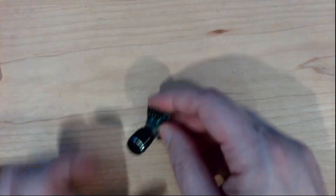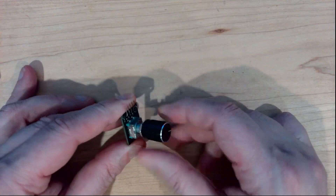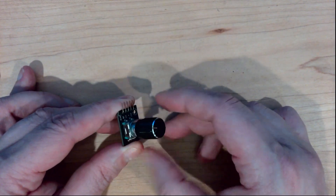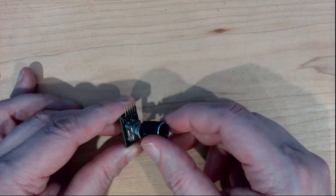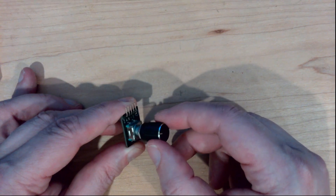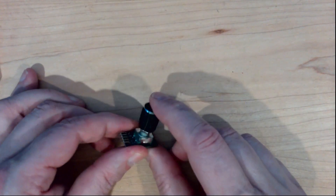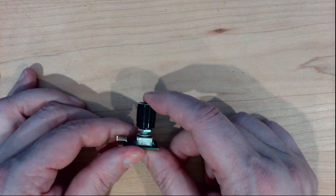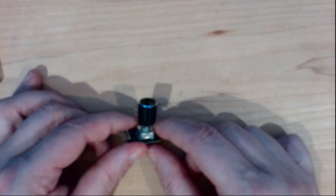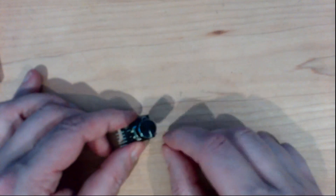This is a rotary encoder. A rotary encoder has infinite rotation, so I can turn it either direction as much as I'd like. One of the other things you'll notice with these is they kind of have a bunch of detent. As I rotate it, it's not smooth — it clicks. And this one even has a push, so I can push it in. It also has a click there. This is something that would be really common, like as a volume knob or something like that. My 3D printer has one for navigating through the menu.